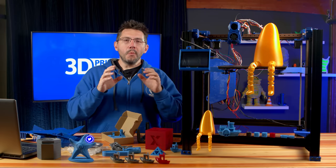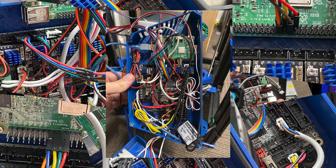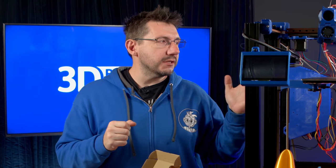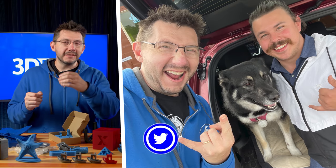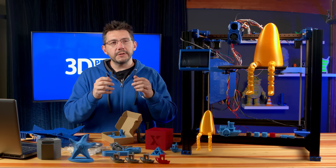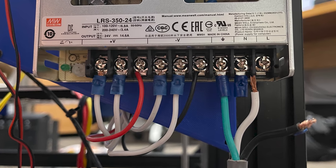The other person I want to give a shout out to is Brett. When I replaced the electronics enclosure, I took a ton of photos so I could make sure all the wires and plugs went back in the right spot. In doing that, I discovered that one of the wires for the auto-leveling probe broke out of the JST connector, and I didn't have a JST connector set or crimper at the house. My buddy Brett did, so I met him at the coffee shop and got the crimp set from him. While I was putting the electronics box back together, I noticed some wires were loose in the crimped connectors on the power supply, so I re-crimped all of those and they're now nice and tight.